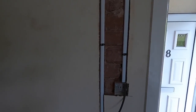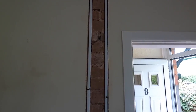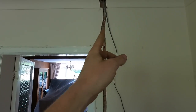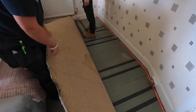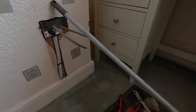It's just old plaster - it just fell off - so we are going to go around on probably the last day and get a bag of bonding. I'm just going to chuck some stuff in there - always spray with some water and some PVA first just to absorb the dust, something to stick to. I think it's a great finish. This one got a bit messed up because I had to chase the wall downwards as the Metabo was overhanging, and as I went the plaster's that thick. It ran away from me, but it's within zones. You take a two-and-a-half from there across here, step over first, fold it, leave it there. That far side is now in for the socket in the corner of the lounge.